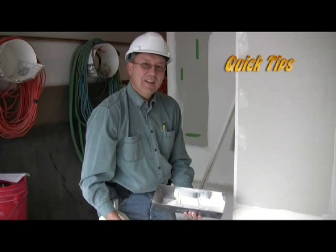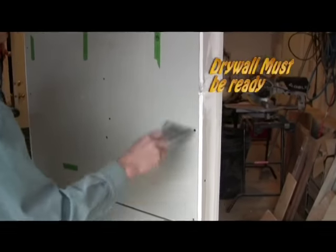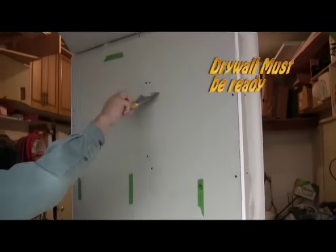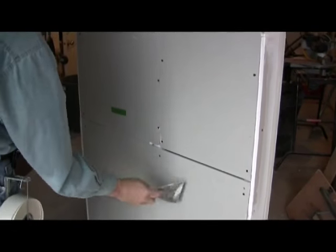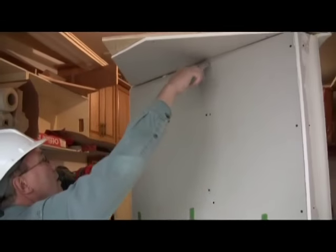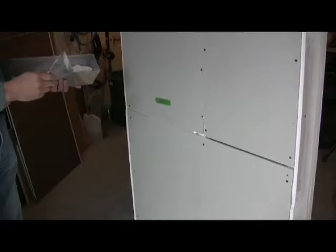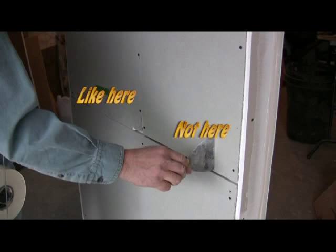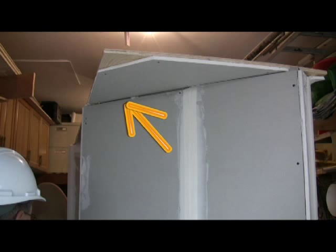Now several tips before we start. Number one: drywall must be ready. Great drywall finishes begin with superior hanging jobs. The drywall must be tight against the wall studs or the ceiling joists. All screws need to be countersunk just enough so that they do not tear the paper. There need to be enough fasteners — I like to see screws every 16 inches on walls and every 12 inches on center on ceilings. Tapered seams should be tight. Corner joints or other joints may have a gap of approximately a quarter inch. A tight seam is best, but a slight gap is acceptable.